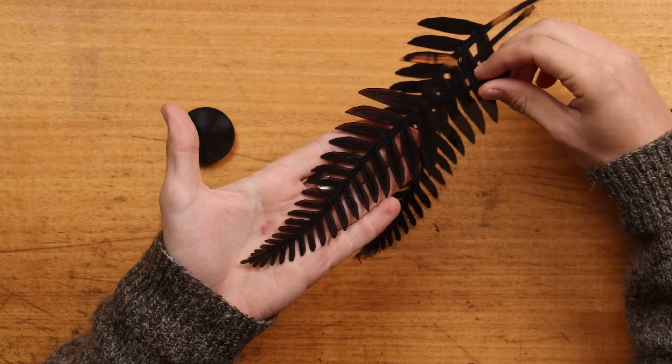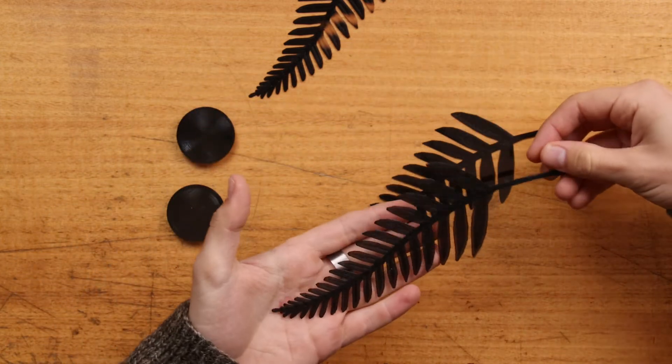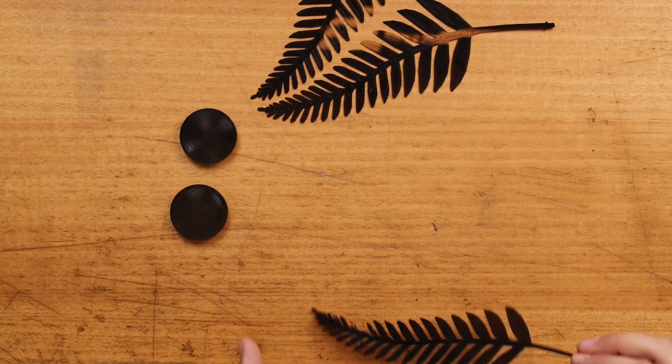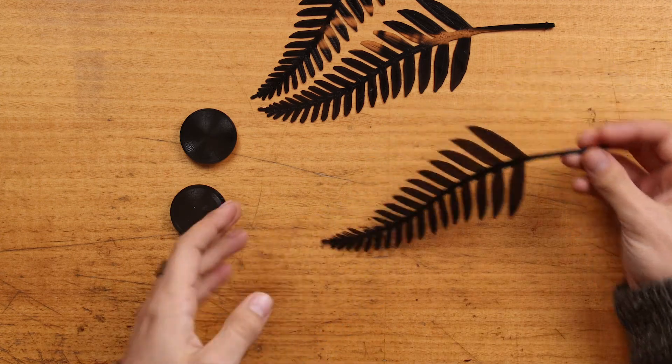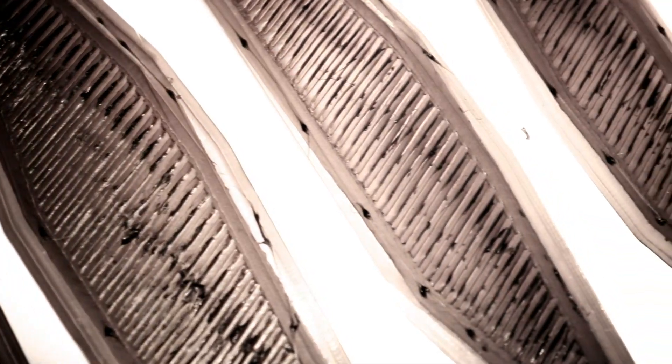If you're looking at these single fronds you can see exactly how shiny these pieces are. This one hid very well, this one you can see a little blemish right there, and the initial one that I printed you can see where it runs into issues at the top. Putting them in order of how I printed them, you can see an improvement between these results. The print that failed used a weaker initial squish compared to the two successful prints which used a higher initial squish consecutively. Squish was altered entirely in settings within Cura.